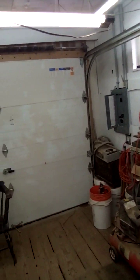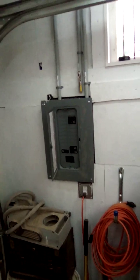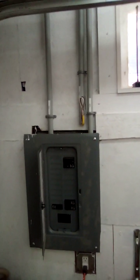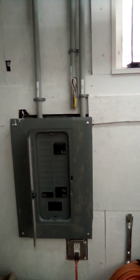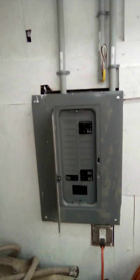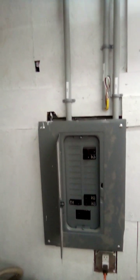The other thing we've been doing is my friend John Hilligans has come out and helped me hook up a bunch of wiring. We put in a couple more breakers — have one more to put in. You can see that one wire out there, that's 12 gauge, that'll run a 20-amp circuit. We now have a couple more circuits in that weren't here before.